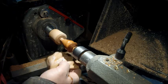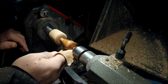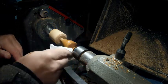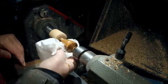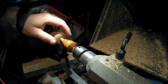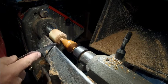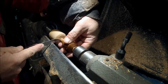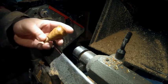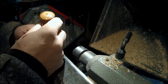I have a little suede here and some Briwax friction polish — a little friction, work that on, and then we'll polish that up. And there we are. Now we just part this guy off. I have this old cheap kitchen knife that I turned into a parting tool. Okay, so that came off. Now we need to sand the top. There's our bottle stopper — real quick, we just need to sand this off, polish it back up, and there you go.